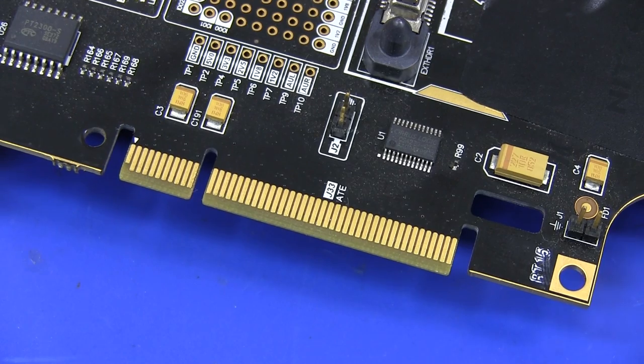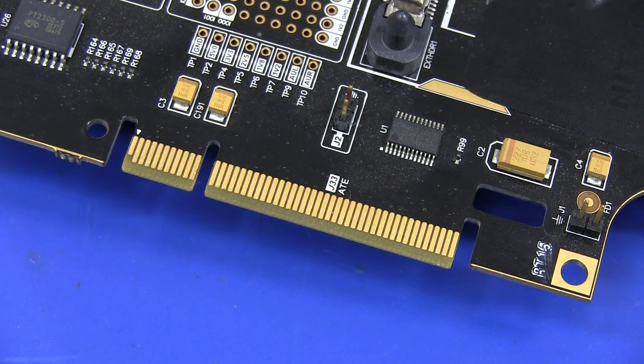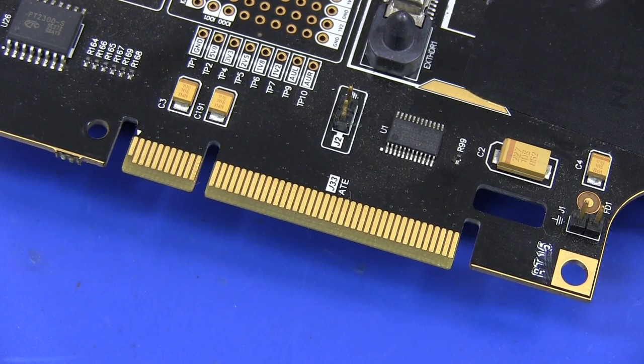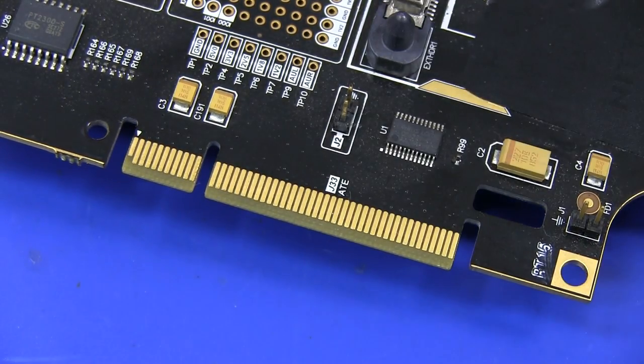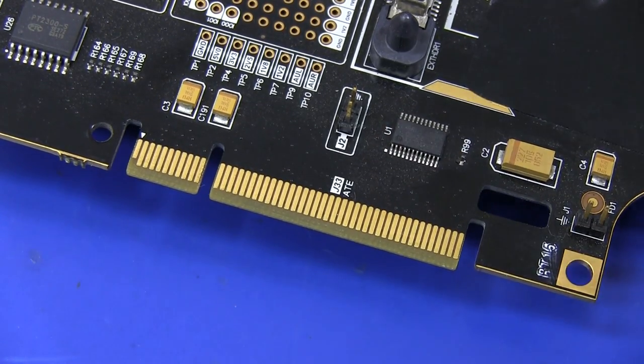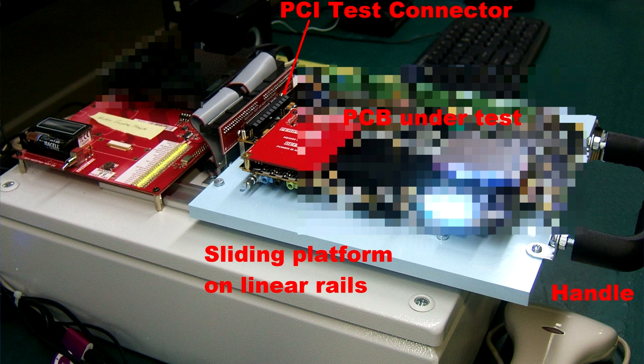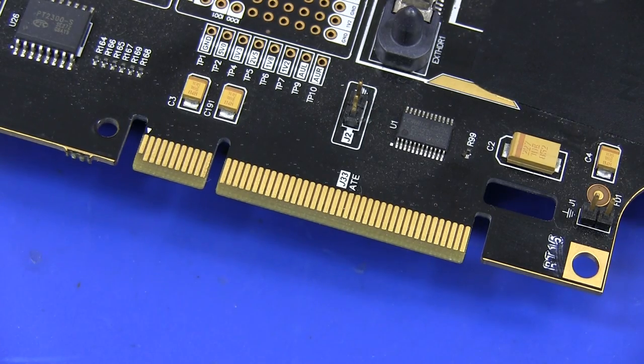In the design process we routed all of these signals out in parallel with other stuff, with dedicated I/O pins coming from the processor and FPGA to enable this functionality — designed in from day one. Of course, we could have used a 0.1 inch header, and that's okay if the board isn't going to be visible to the public. But the thing about header connectors is you've got to physically plug a cable into them, which can go wrong — bent pins, messy, takes time. This card edge PCI connector let us mount the board on a sliding rail system; you just slide the board on and push it into a purpose-designed test jig with the PCI connector, which works really well — very quick and simple.